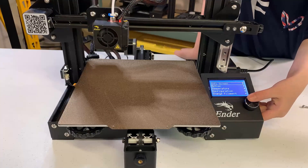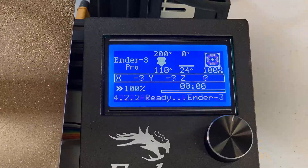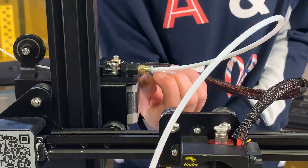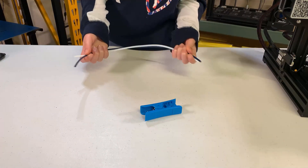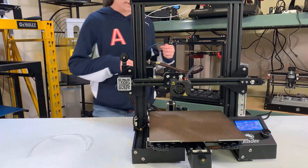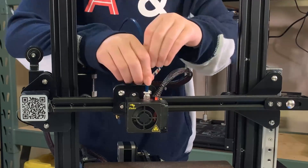After that, we will install the Capricorn PTFE tube. In order to remove the existing Bowden tube from the hot end, you need to heat up the heating block and the nozzle. Once it reaches temperature, press the button on the coupler to pull out the old PTFE tube. Remove the other end from the extruder. We can use the old tube to measure the required length and cut it to the exact same length. If the nozzle cools down, heat it back up again. Push the new PTFE tube all the way down to the nozzle — make sure it reaches the bottom of the heating block and touches the nozzle. Leaving a gap will cause the nozzle to clog.